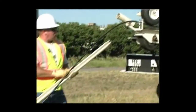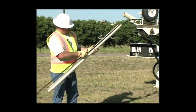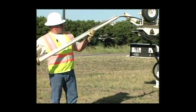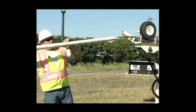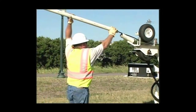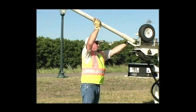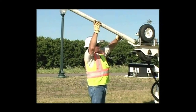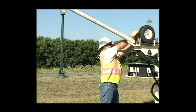Remove the PVC split tube and feed the fiber optic cable through the split tube assembly. Twist the tubes to lock the cable inside and re-secure the split tube in the tube holder. Lock the upper tire of the figure eight accessory into place. You are now ready to begin spooling the cable off the reel.